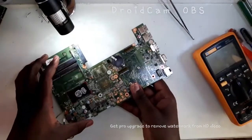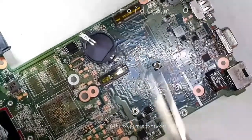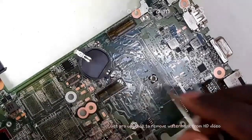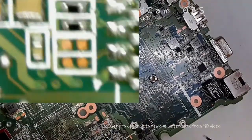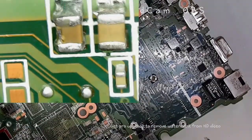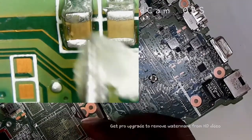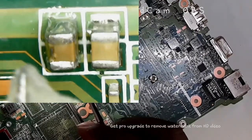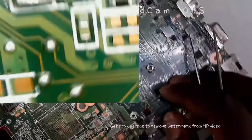I've found a capacitor here that is heating so much. Let me zoom in. These two capacitors here, near the BIOS, they are heating up so much. So these capacitors — this one looks to be broken. And when I put the flux, it melts immediately. One of them is short. It looks to be this one. So let me take it out.